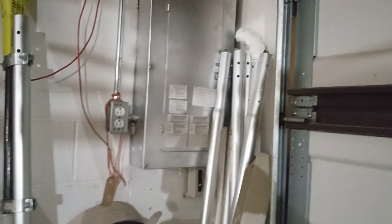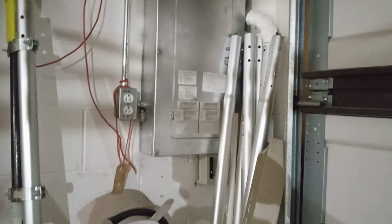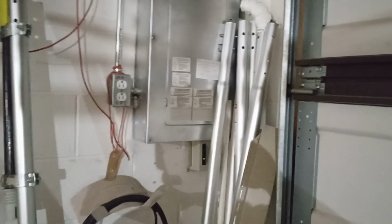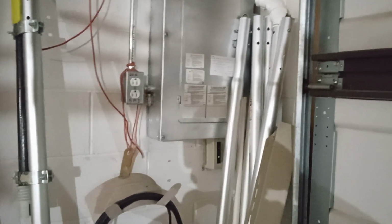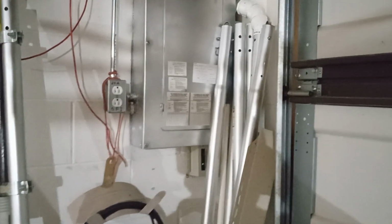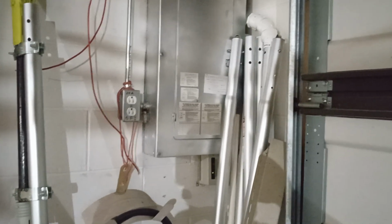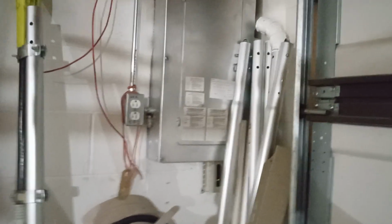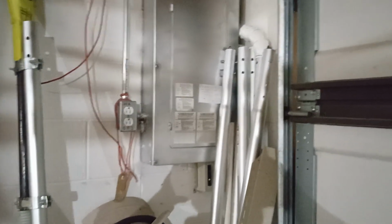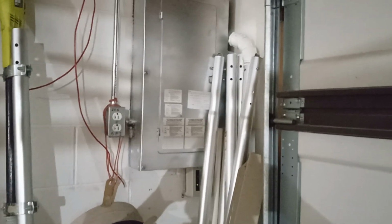The purpose of multiple ground rods is not about lightning, it's about poor soil. We have real poor soil here in Tennessee. Multiple rods are for better grounding in soil that has poor conductivity. It's got nothing to do with radio equipment or lightning. It's an absolute fool's errand to pretend that we're going to ground something as lightning protection. That's completely contradictory. In other words, as protection to prevent a lightning strike, all grounding is going to do is encourage it.